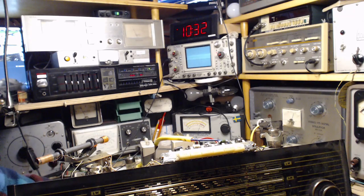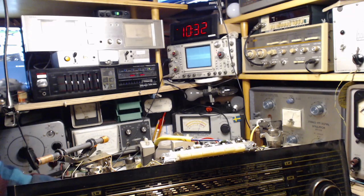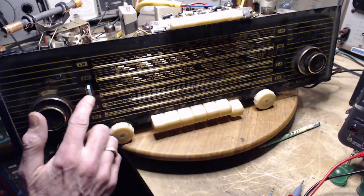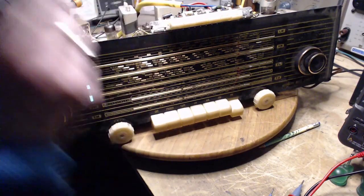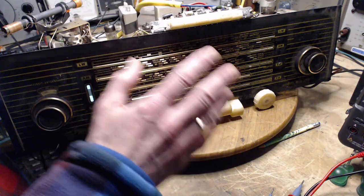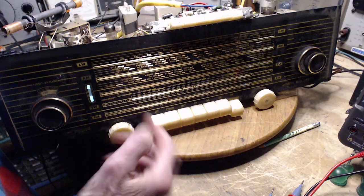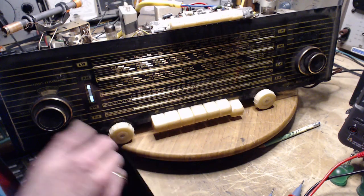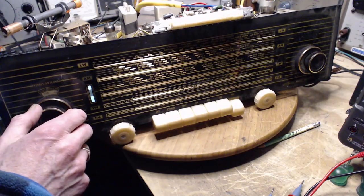And it's slightly above. So the receiver is receiving the test signal slightly stronger on the Magic Eye than the radio signal we were just listening to. All this is telling me that the key thing to make this radio sound good is to have a really good FM antenna that gives the radio a good chance to do what it's doing now, which has worked quite well. Now there's a built-in FM antenna in the console. That might be enough.